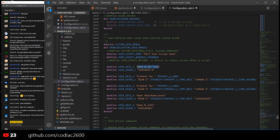I do something like nozzle change. So G28 is home, and you have to have the N key for the next line. So you can do G28 home, and then G1 F2000, X will move to 125, and then Y will move to 110, and Z will move to 100, and boom, and N, and M, and 10. Oh boy, this is where my brain doesn't work anymore. Preheating the nozzle and the bed. Is it M109 or M190? That's the fun part.